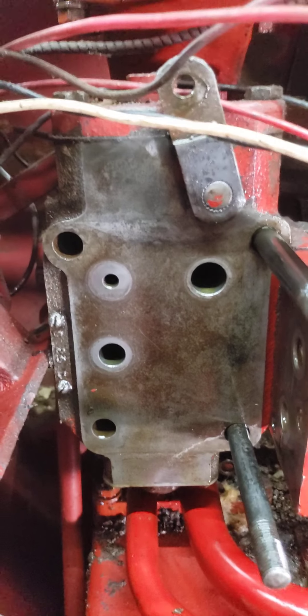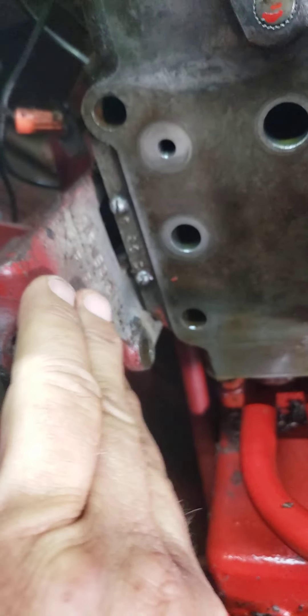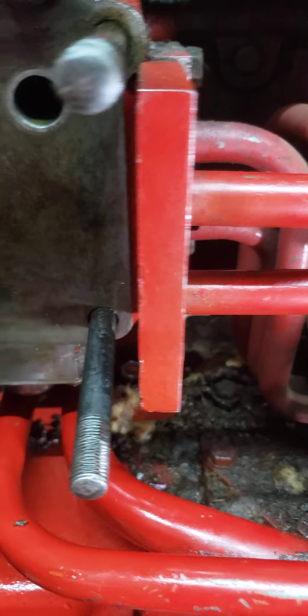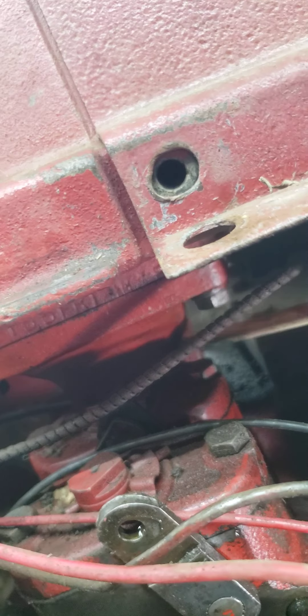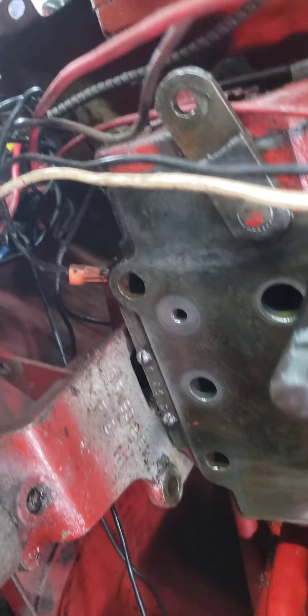I've got one of the actual valves out right there. To get it out I had to remove the handles, and back here you have to take the bolts out of the permanent steel hydraulic lines, which you'll see have two o-rings each. There are o-rings here, here, and here, and corresponding ones on the back — another set of o-rings — and on the back of the valve there's another set as well. All these o-rings over time get compressed to the point they just won't seal. On this particular tractor I also found the oil pressure line was leaking quite a bit, so that was probably half of my oil leak.